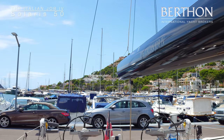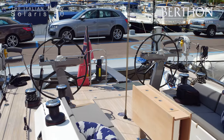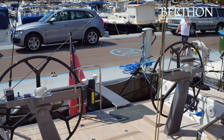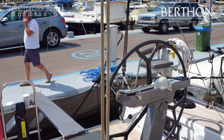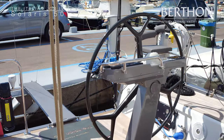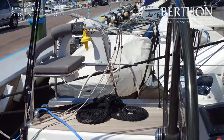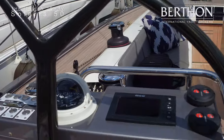There's a nice view of the twin carbon steering wheels and six winches. The four winches near the helm positions are all electric; the two on the coamings are manual. Two of the four electric are rewind winches with controls on the steering pedestal, so the main and the jib can be trimmed in and out by the helmsman.